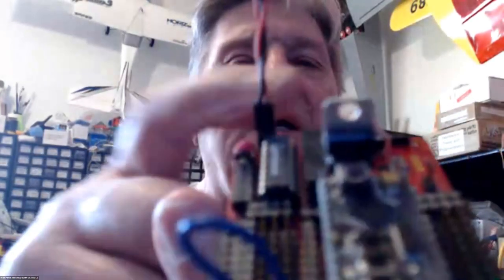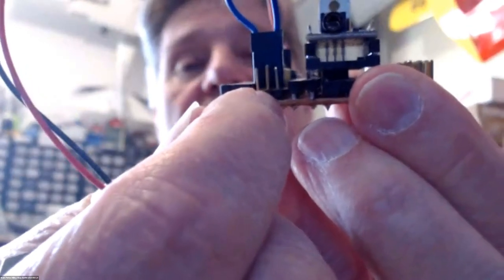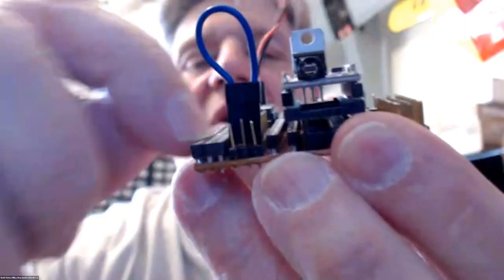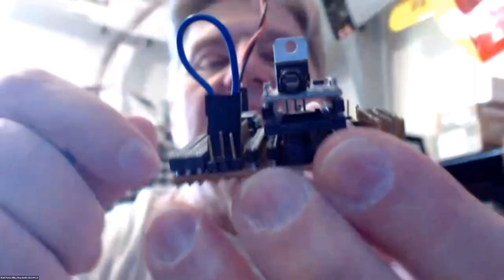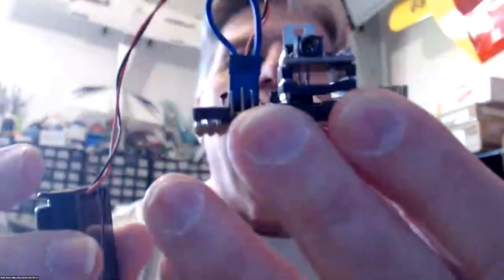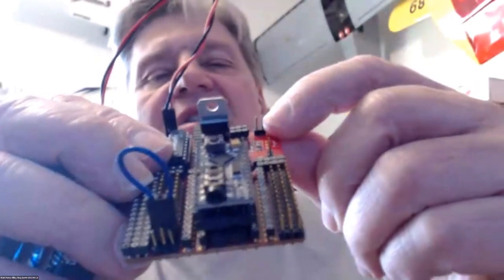So I set up a standard on the board so that the plus goes towards the inner part of the board, and ground is on the outside. And that's the same with the breadboard things. These three conductors here is signal, plus 5 volts or 3 volts, depending on what you're using, and ground, standard RC hobby connections. This little breadboard here is completely separate from that coming out of the chip. This allows you to stick little pieces on there and then jumper from the chip over here for like LEDs and stuff. And the same thing with the power switches, ground on the outside. Well, actually, there's no ground here. It's just a switch to connect these two pins together. So you could use a jumper plug or a power switch, which I don't have any switches here.